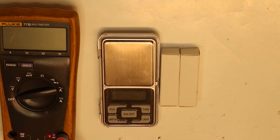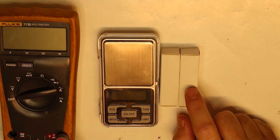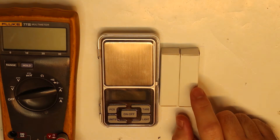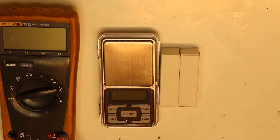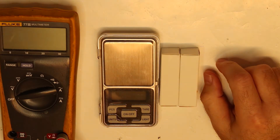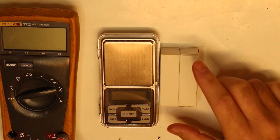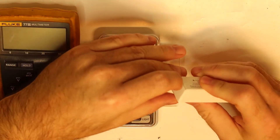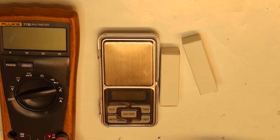Hi everyone, I got these new batteries I ordered. What is special about these lithium batteries is that the discharge current is very high — continuous 30 amps, which means one of the most high-current available discharge batteries. For example, if you want to use the cells for a Dyson wireless vacuum cleaner, these are the cells. It is Sony VTC6.